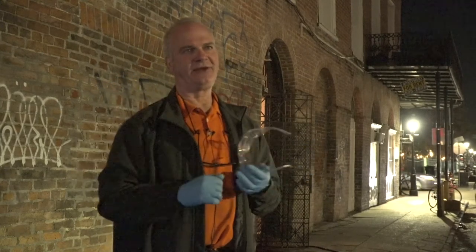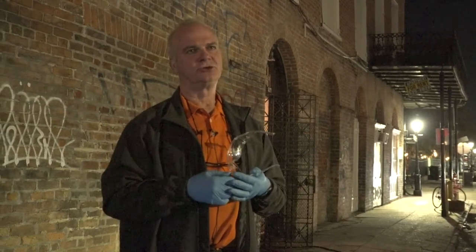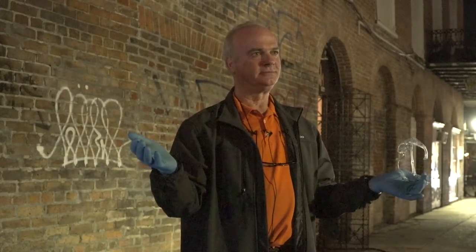It's called asphalt and tar remover, but they're to melt things down like adhesives, because you wouldn't want to go after something like that with one of these, because you'd probably strip the paint off of the gutter. So it depends on what it's on, which brings up, if they're spray painting something that's painted, we can't take the graffiti off without taking the paint off of the building. So if you have painted properties, most people just paint over it. You can't train your paint stripper to stop. It's just going to keep going.